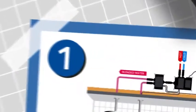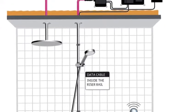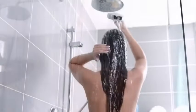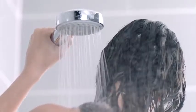At the heart of each shower is a digital processor no bigger than a shoebox, that can be sited in a loft, airing cupboard, or even under a bath. The processor detects fluctuations in the hot and cold feeds to ensure a perfect temperature at all times. Each processor has an optional eco setting, which can reduce water flow by up to 33%.